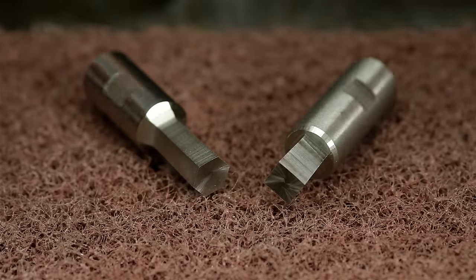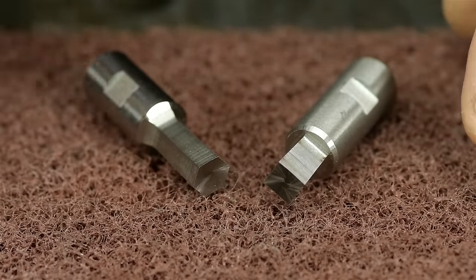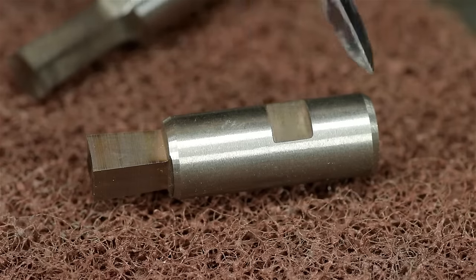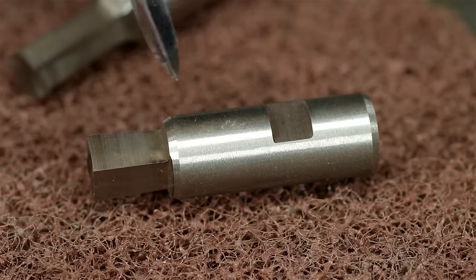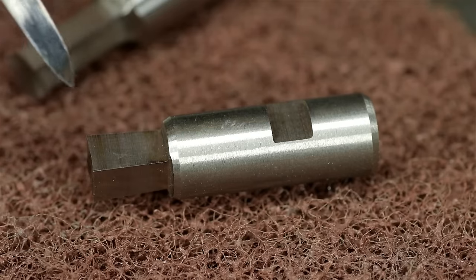One of these two is a store-bought hex broach. The other one is a homemade square. Can you guess which is which? I ground in a small flat for the set screw on the rotary broach and just broke the sharp corners. Spun on a little bit of a chamfer. And then just honed the business end on a bench stone. Nothing left to do but...